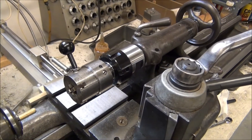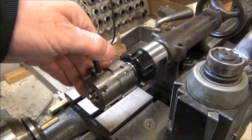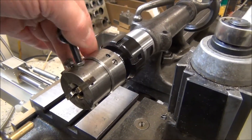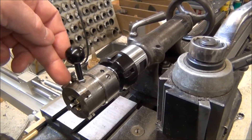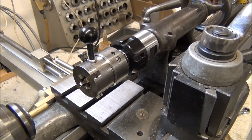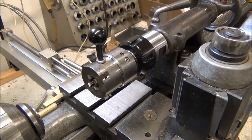So let's look at this. The way this works — if you're not familiar with these — is those dies open and close. Instead of a fixed die, these can open, and this is spring-actuated, so when it reaches the end of travel it will snap open and you can retract it off of the stock that you're cutting without having to reverse the spindle. So if you're going to do a lot of threading, this is a fabulous tool to have.